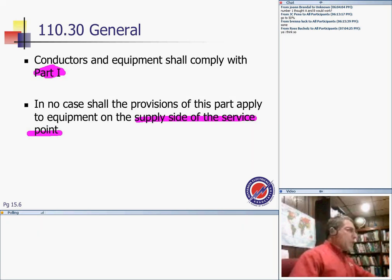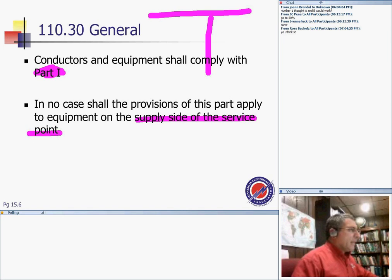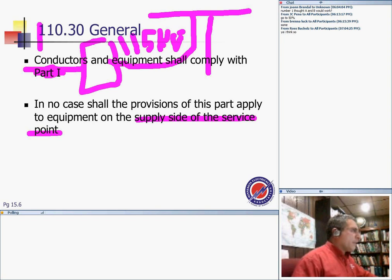So what are we talking about here? I have my power lines coming from here, guys, all on medium voltage, and I brought in a 115 kV line, and I bring it to my transformer here. Out of my transformer, I took 13.8.